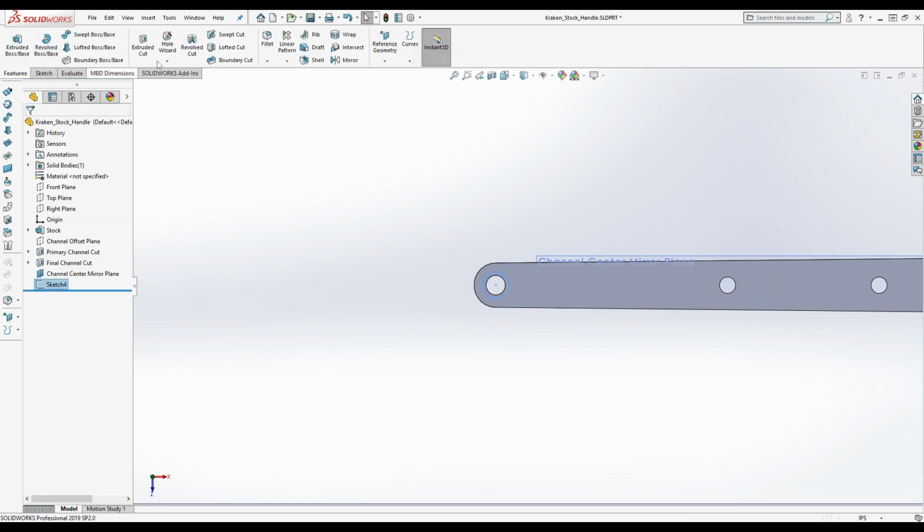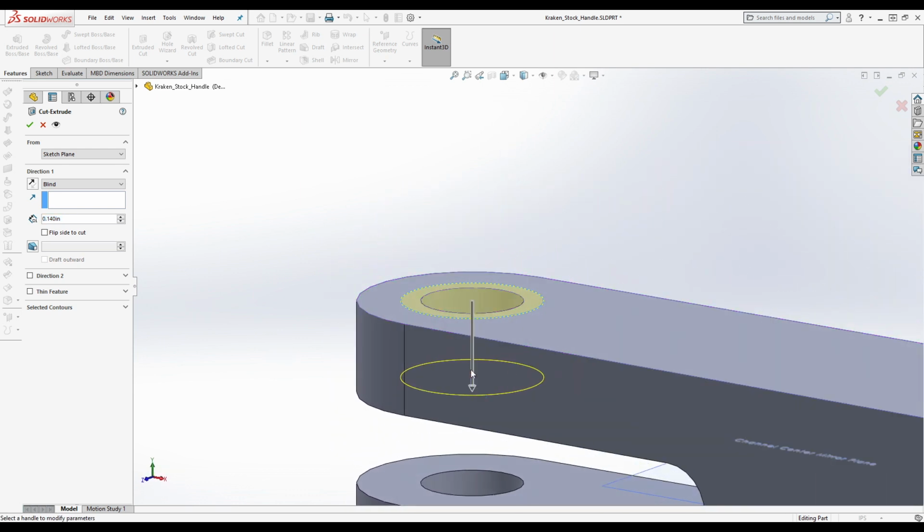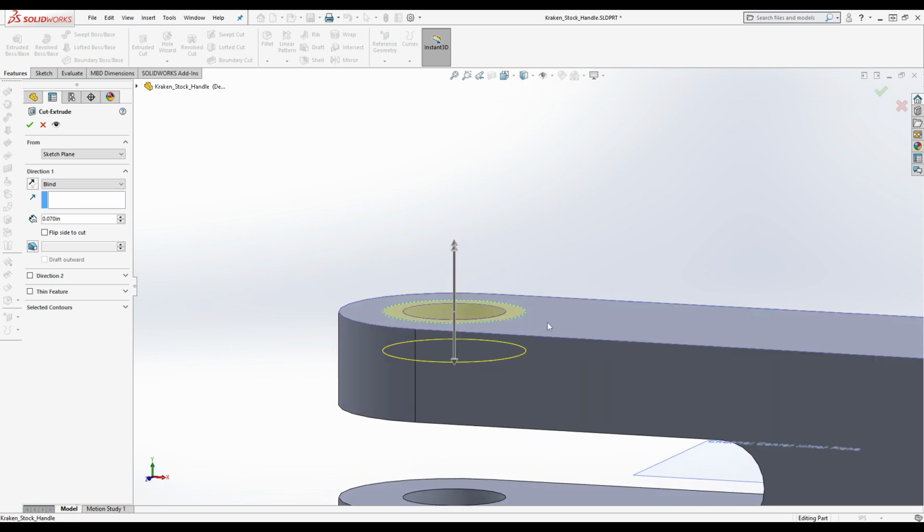So all we're going to be doing is an extruded cut. The reality is, it's very tempting to say this probably goes down, and we'll see. In fact, let me check. It looks like he may have done it this way, but what is the overall thickness of this? He did it a way that I would disagree with. When you're making models like this, you need to be doing offset from surface, because the distance from this top surface is irrelevant.